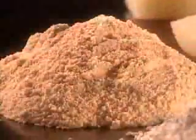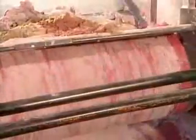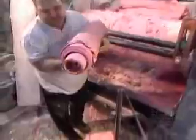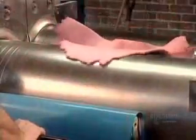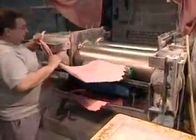Next, vulcanized vegetable oil. That's vegetable oil treated with sulfur, then regular vegetable oil, then calcium carbonate as a filler. When the color and thickness are just right, workers remove the rubber, which by now is hot and soft as a result of all that milling. They leave it to cool and harden at room temperature for about half a day.